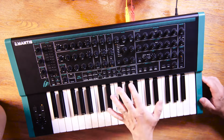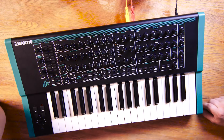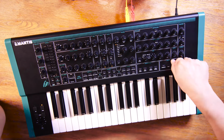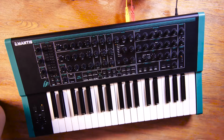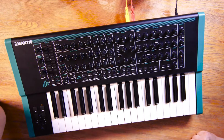However, there are different ways of using them. So if you use them like that in a mono mode or in quad mode without the duophonic on, you've got access to all those filter types. When you put duo on, it actually separates the filters and puts one on each of the signal paths with a stereo spread. Oh, wow. But you've only got access then to the top three, because they're not in parallel or series anymore, they're actually separate channels. Yep. Okay. Oh, okay. I get it.